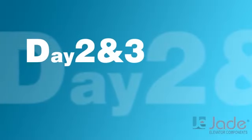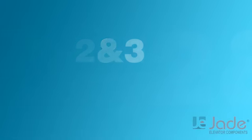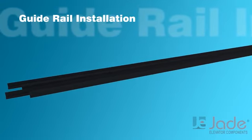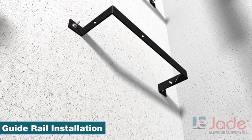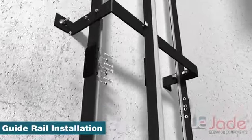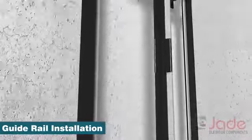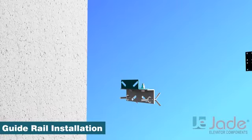Day 2 and 3. It consists of guide rail installation. With the help of scaffolding platform, guide rail portions of 2.5 meter or 5 meter are assembled with the corresponding support bracket. After the installation of the guide rails, it is recommended to examine them and make sure that they are aligned.